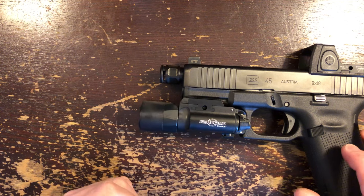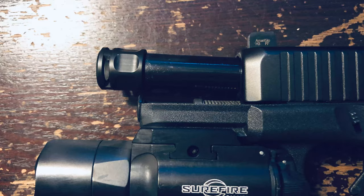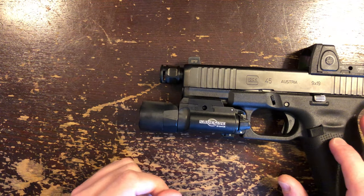The ones that really push the gun down are more likely to cause reliability issues because they interfere with the tilting barrel that nearly all modern guns use to operate. The compensators push down on the barrel whilst it wants to tilt up, and they're a big heavy weight hanging on the end of the gun. So you have to swap recoil springs and rarely other things too. I'm just not into all that.